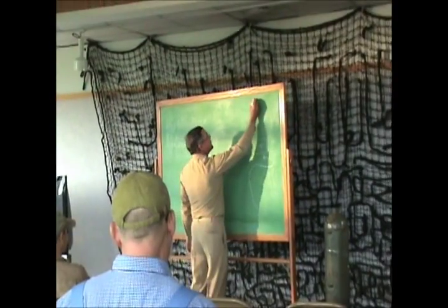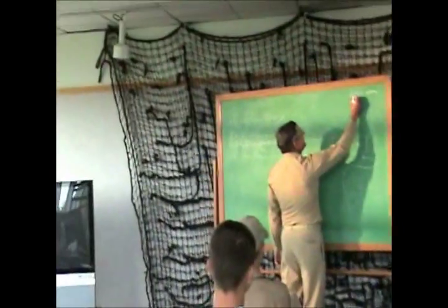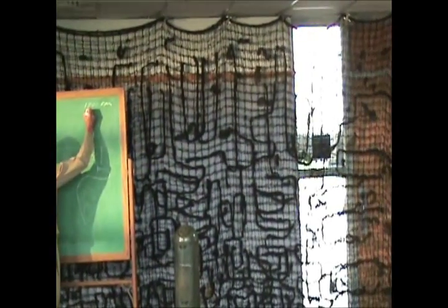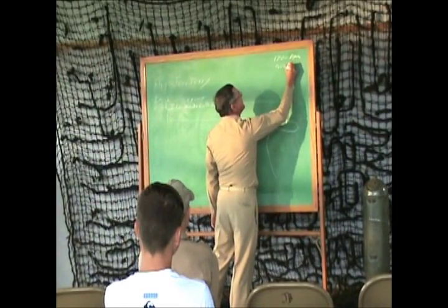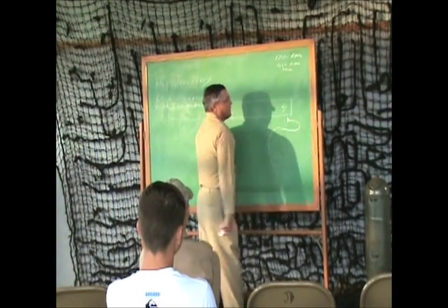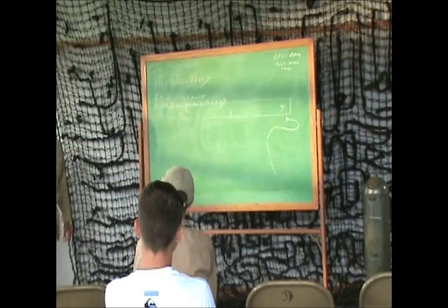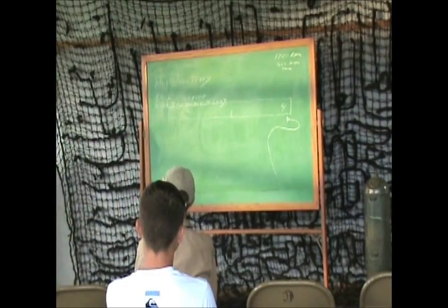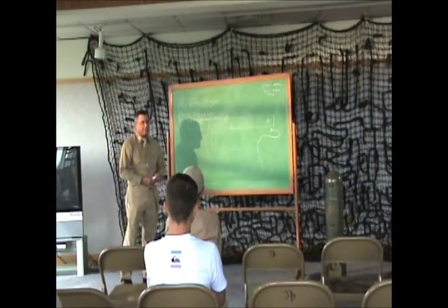And so the first thing we do is we check temperatures. We bring it up to 1,700 RPM. And once it's stabilized at 1,700, we cycle the props. Does anybody know what that means? It means to change the pitch on the props. Change the pitch on the props, exactly. And why do we do that?